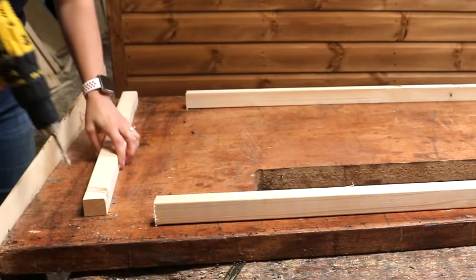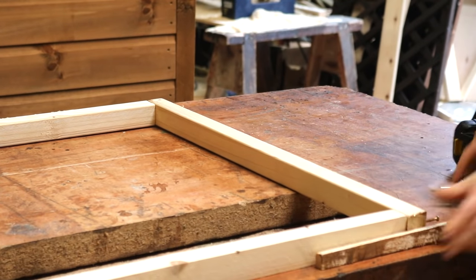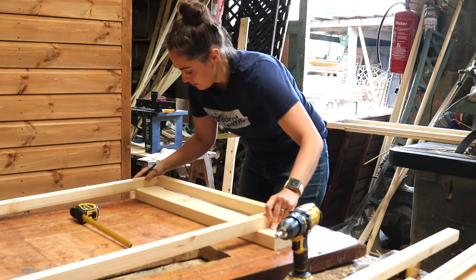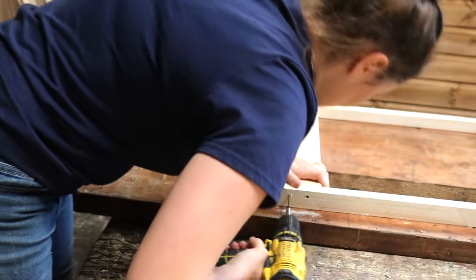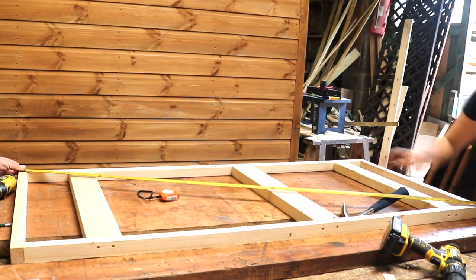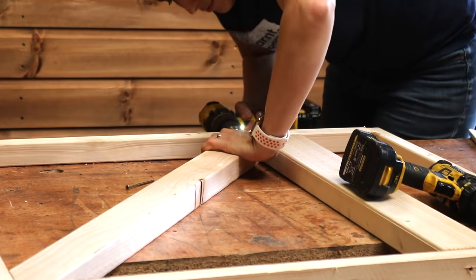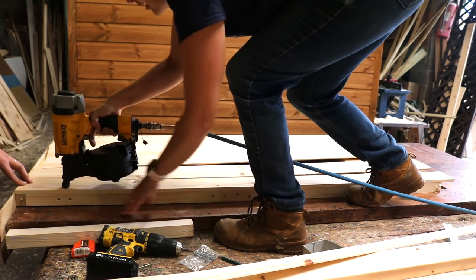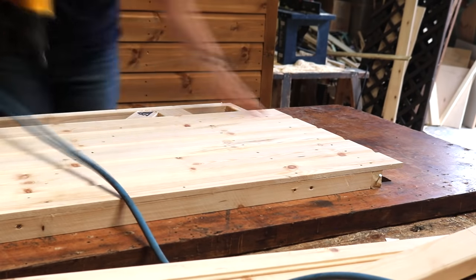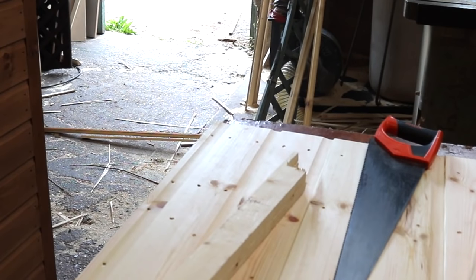Here's my framework — I pre-drilled and screwed them together to make a rectangle, then started marking and screwing where the cross supports would go. I checked for square again. Then the all-important Z-brace to prevent any sagging — the downward part should be angled towards the hinge side. Then started nailing the cladding on. It definitely helped with the frame and the cladding pushed against a flat edge on the workbench. For the trim, I hand-sawed a notch out to match the door's cladding overhang — otherwise the door won't close properly — and nailed a piece either side.